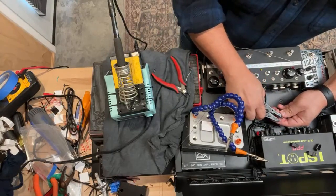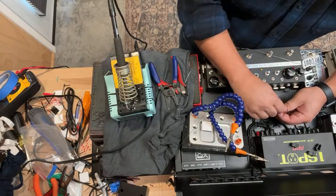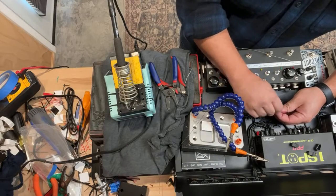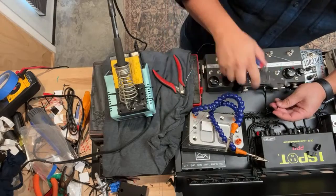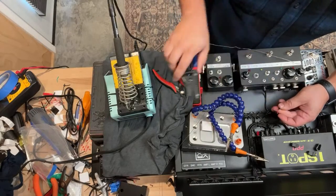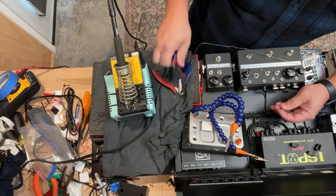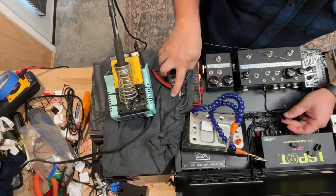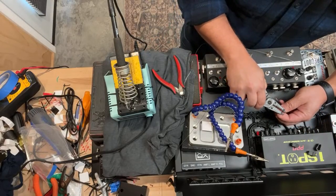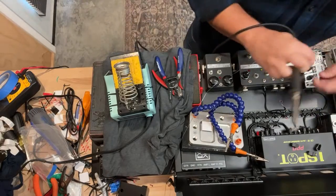And then when I'm prepping these cables, assuming that the polarity is the normal pedal polarity, I'll strip the insulation off totally on the ground so that wire is fully exposed. And then I'll take the minimal amount possible off of the tip because I want the full benefit of the insulation around the center so I don't get any ground out.